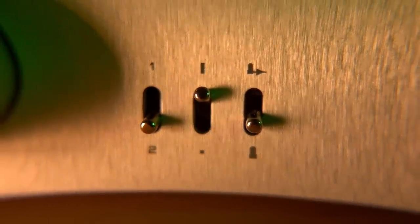There are three toggle switches on the front. The first selects between two RCA inputs on the back. The second is a gain switch that also functions as an output impedance switch — switching it changes how the tubes are connected within the circuit, giving you more power in high gain but also more output impedance. Output impedance refers to how hard it is for the amplifier to push voltage and current through the headphone socket. The traditional rule of thumb is that output impedance should be about one-eighth of the headphone load impedance.